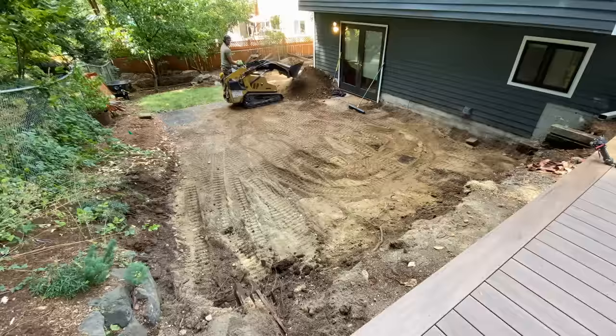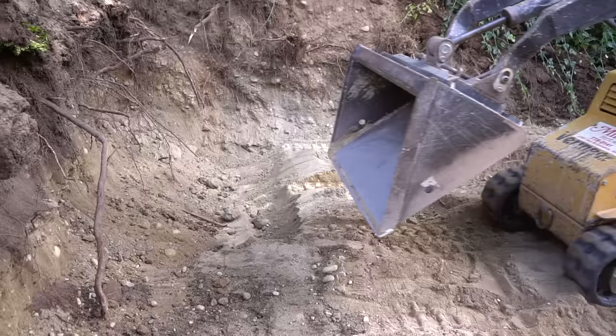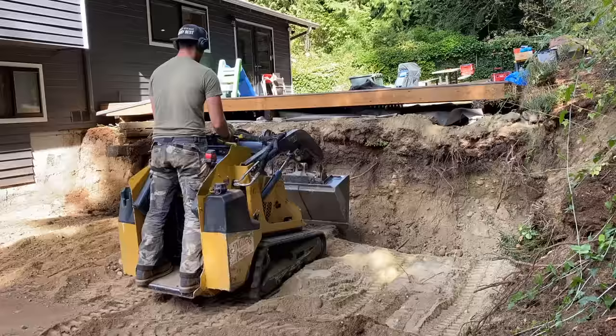After I have all the timbers, large rock, and excess soil completely removed from the space, I can then start my trenching. The trench itself actually has to be one foot deep because we have to account for approximately four to six inches of crushed rock and then one of our six by six timbers on top of that, which has to be below grade.